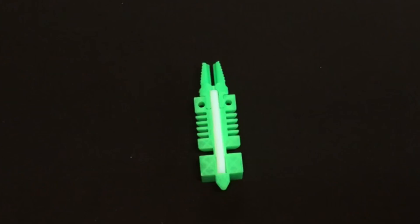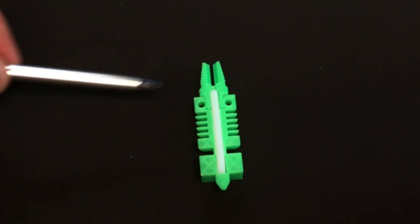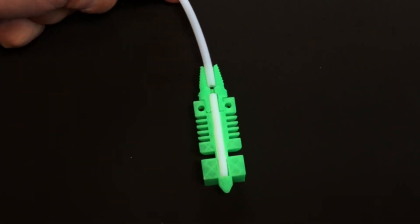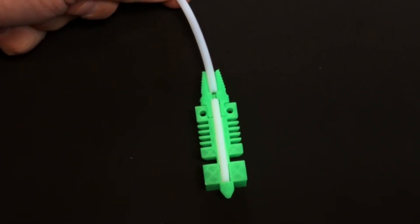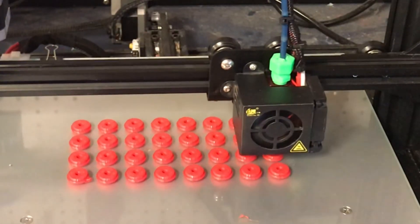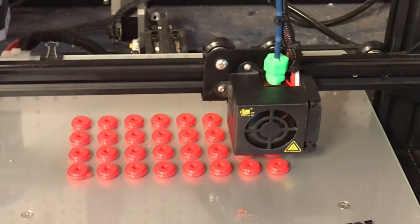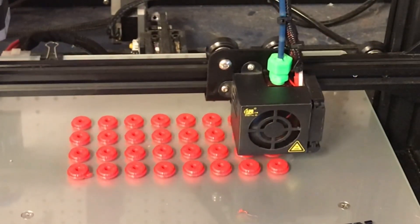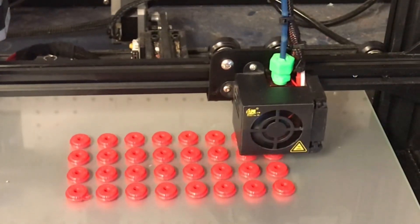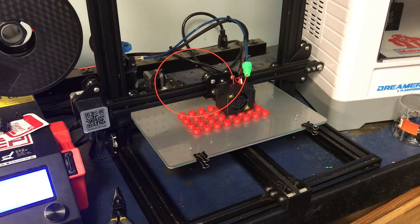So that's what I did. Here it is mocked up — there's the PTFE tubing and my new coupling on top that screws into place. The PTFE tube is longer so it's easier to reach, then the top piece comes in and you clamp it down with the nut. I installed the 3D-printed coupling on one of my CR-10 minis in my print farm. This particular machine prints little plugs for a customer and runs 24/7, so I thought it was a great test. It seemed to be holding up and wasn't moving at all — but when I came back I saw it had popped out.